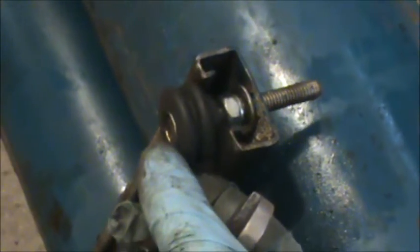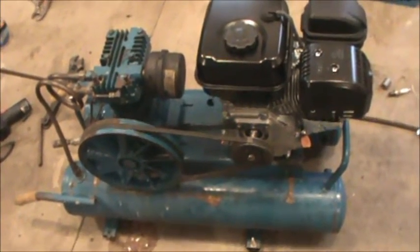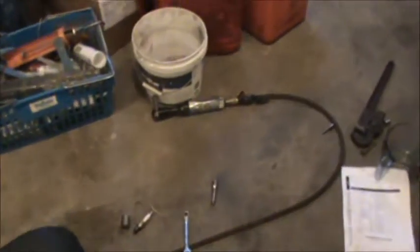I pulled the motor off and noticed the compressor oil has water in it, so that needs to be changed right away. The foot pads on the bottom — there are three of them, the fourth one's missing — so I took some spare parts and created a foot to bolt on while I had it on its side. About 20 minutes later, everything's on there. The engine went on nicely, the pulley went back on the new engine — perfect fit. All bolt holes lined up exactly. I used a 3/8 impact ratchet to tighten the mounting bolts from underneath.